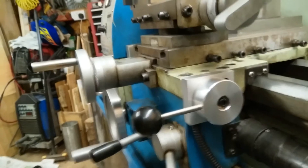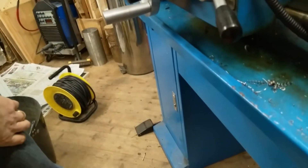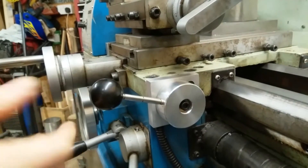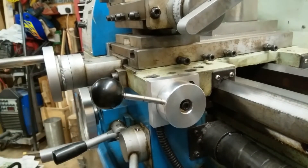The emergency brake pedal is down on the floor, down there. When that gets pressed, irrespective of what position it's in, it will stop the lathe. You have to return it to the neutral position and then back to a rotation to get it to turn.